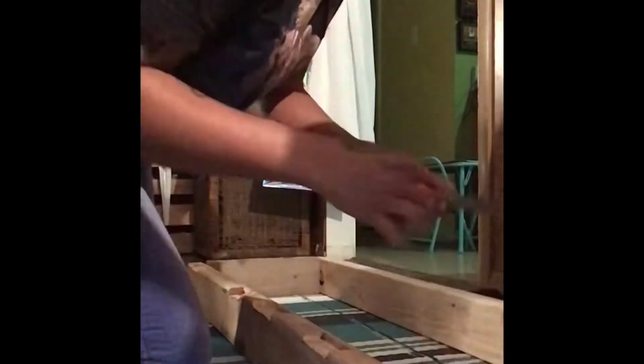And all I'm doing here is etching out my line, getting it straight with my straight razor. I'm going to use my chisel here and make sure that the bevel part is in and the flat part is out. That way I don't mess up the back part and I can keep that straight and flush with my etching that I've already done in my wood.